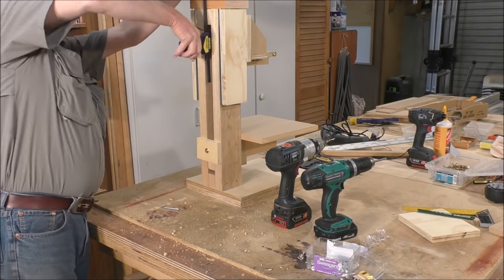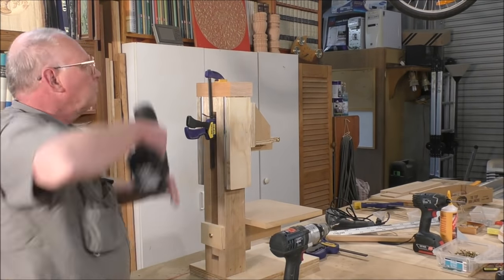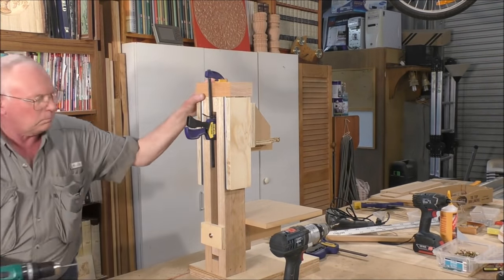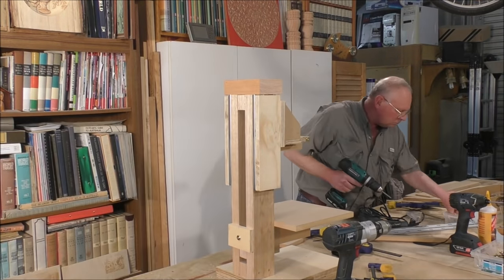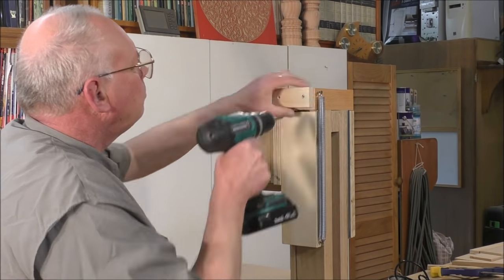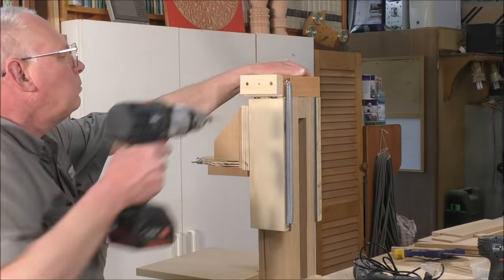I do actually try the drill in there and line it up and get it right bang in the center, and then I put a second, a third, and many more screws in to make it really secure. This piece I'm putting on the top is a bit of a stage up, because I needed to go a little higher, and I needed something quite substantial in order to put a spring on and put the mechanism for the action, to plunge the drill down through. And this is part of the mechanism now I'm putting together.